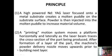The LENS process works on the following principle: a very high-power neodymium laser is focused onto a metal substrate, which creates a molten puddle on the substrate surface. Powder is then injected onto the molten puddle to increase the material volume. A printing motion system moves the platform horizontally and laterally as the beam traces the cross-section of the part being produced. After formation of each layer, the powder delivery nozzle moves upward prior to building the next layer. The LENS process can convert metal or metal oxide powder to metal parts, in many cases without any secondary operations. It is similar to selective laser sintering, but the metal powder is applied only where material is being added to the part at that moment.